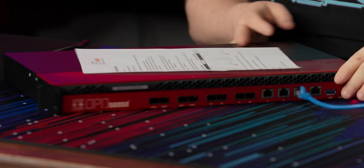Port 0 is assigned to LAN address — there is actually a port labeled 0. Port 1 is assigned to WAN and uses DHCP to obtain an IP address. We'll plug our incoming internet connection into WAN, which means this box should now have internet, and then we need something to plug into port 0.